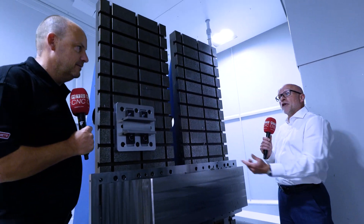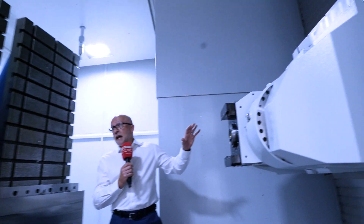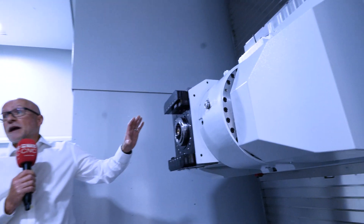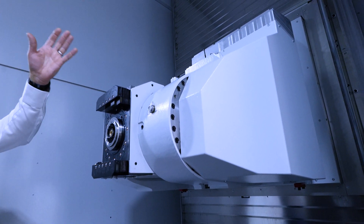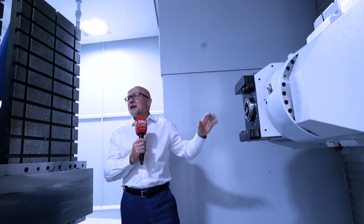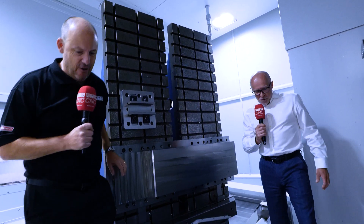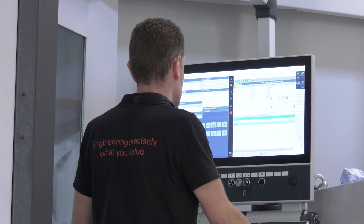Here you've got Starag's famous STC head — a very heavy-duty HSK 100 head with a heavy-duty adapter plate for angular tools. You've got a dampening brake system, vibration sensors, thermal sensors, and displacement sensors — very advanced, which you're going to need when you see what's coming next.